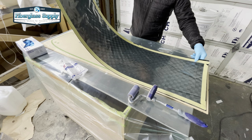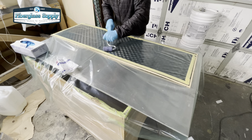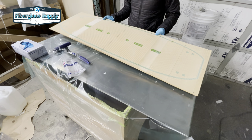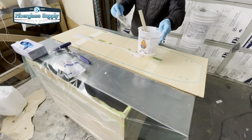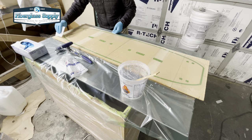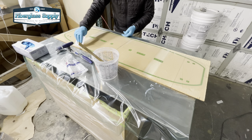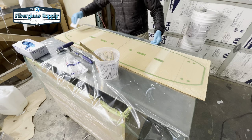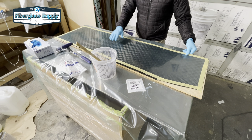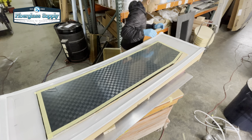You do want to make sure that you've got epoxy all the way past the edge of the board. This is super key because we're gluing that skin in place and we need a good bond to have proper strength in that board. After laying that skin down we go over with a J-roller to make sure everything's pressed nice and tight, and we flip the board over and do the same thing on this side. One thing on this board: the center is a little thicker than boards we've done in the past — usually around three-eighths of an inch, and this one's closer to a half inch. That's why there are those transition areas that are a lighter color. If I were to do it over I would redo the code so it ramped up at an even angle. You can kind of see how that's created a lump — I assume if I break this board it's probably going to break in that transition area.